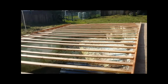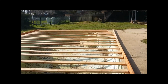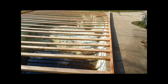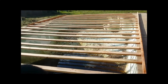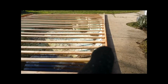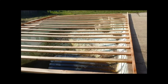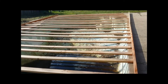Now you can see the frame starting to come together as like a little outer box. Those boards down at the back are uneven. However, you don't want to start spending too much time doing anything until you actually start screwing things in. So we have this first section of the frame done, so we'll actually start getting our screws, flipping the boards upright, and start drilling them in. And once we drill in this first half, you can always go to the other side where you see there's a lot more concrete to play with, and you can always adjust those. But this side you have very minimal due to the slope and the angle of the pool. So always identify where you have room to work with and where you don't, because one thing about it is you can't invent more concrete to utilize. So we'll go ahead and start screwing these in, and I'll give you an update later on in the video.